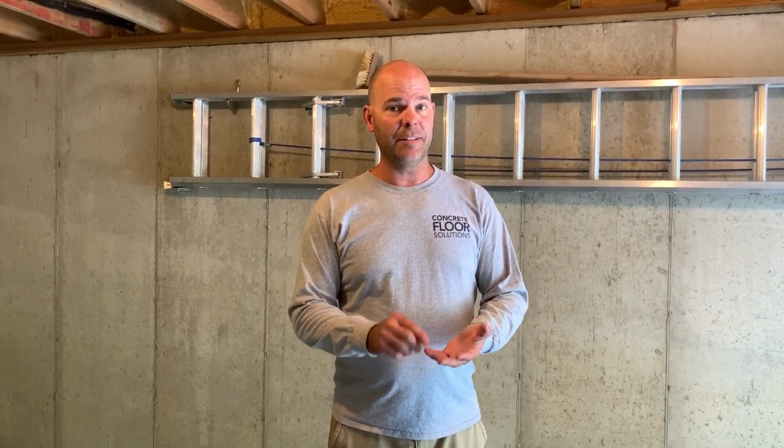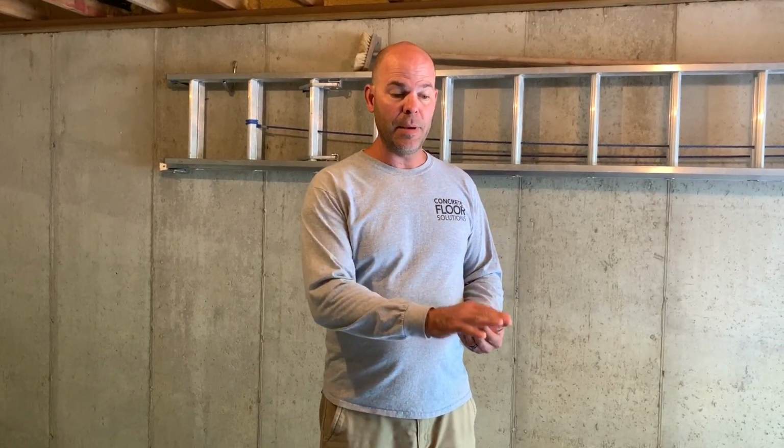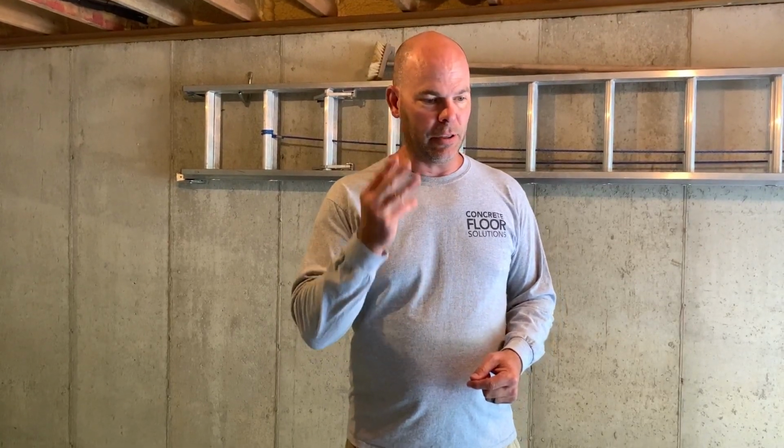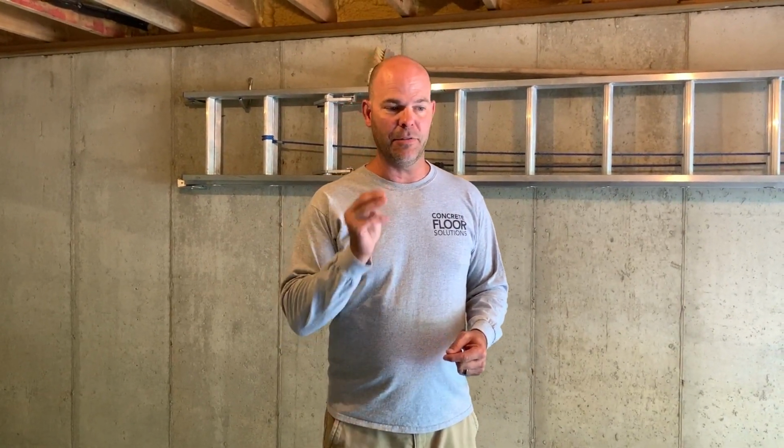This is a 3-coat system. It involves the CFS 707 LVP primer, the CFS 707 intermediate coat, both medium gray. The flakes are added to that, and then the CFS 137 MUV clear coat. It's a 3-coat system, great products, they're very easy to use. Tune into the video immediately after this. You'll see how it's done.